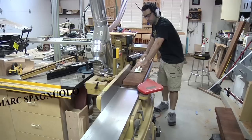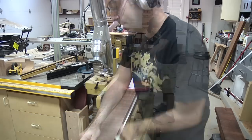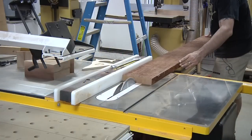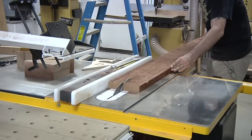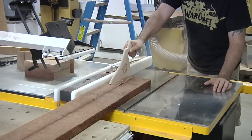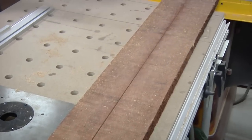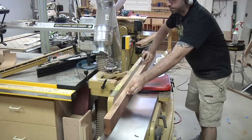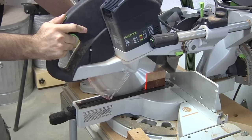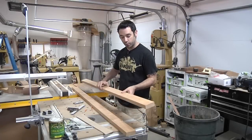Let's move on to the cross members. Both cross members can be cut from a single board, and fortunately this one can be milled without all the precautions we had to take in our previous milling sessions. I joint the face and one edge, and then rip the board at the table saw. After a rip of this length, there's usually a little bowing to deal with. My boards are plenty wide, so it's back to the jointer to straighten the pieces out before trimming them to final width, thickness, and length. Now I've got my cross members milled up and ready to go.